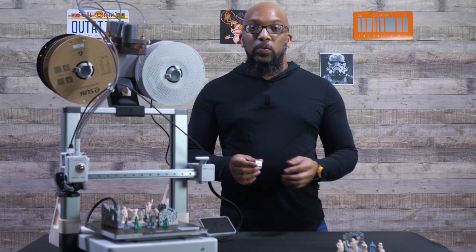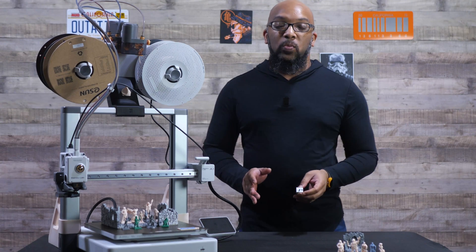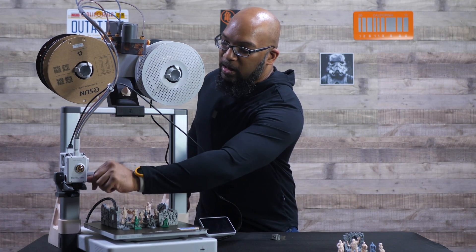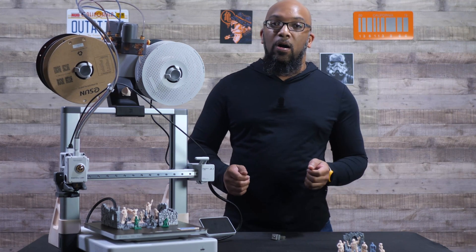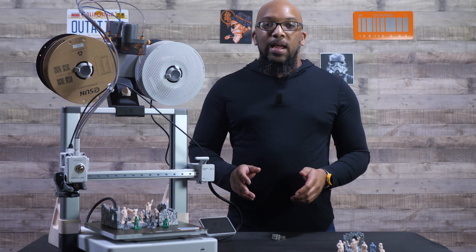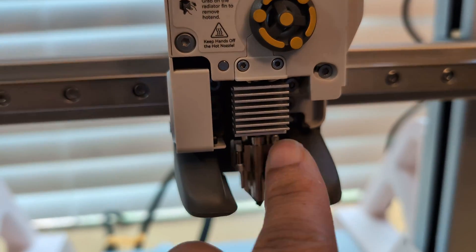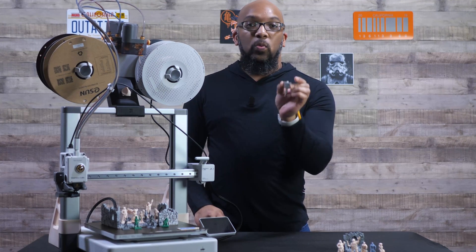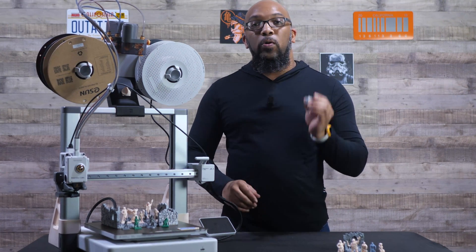If you're curious about the nozzles on this printer, it's this whole assembly right here and it's actually really easy to swap — you don't need any tools at all. There's a covering on the tool head that just snaps into place, so you take that off, then remove the silicone sock. The nozzle is held in place by two clasps that hug it, so you undo those and since it's magnetic you just pull it out, stick the next nozzle in where the old one was, and once it's in place you close those two clasps and it holds the nozzle securely.